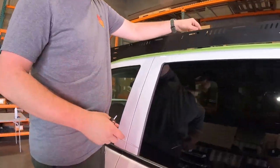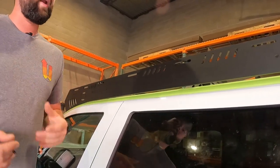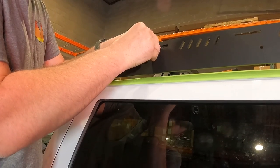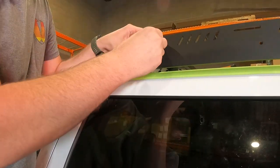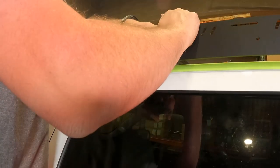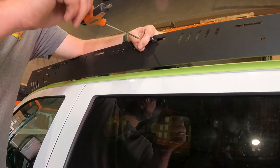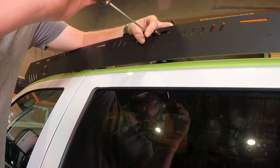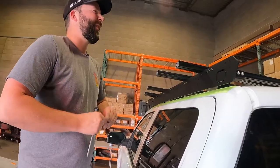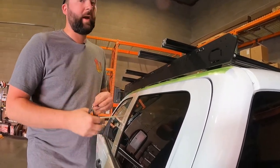Now focus on the middle bar — it can go all the way back or all the way forward, just pick one. Pick up on the rack slightly, get the bolt started, move the bar to position, and tighten it down. The first three load bars are in and tight. We've ensured they're square from side to side — back of slot on both sides, or front of slot on both sides consistently.